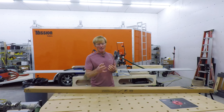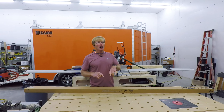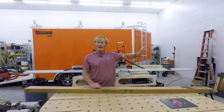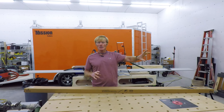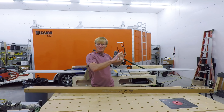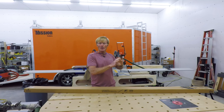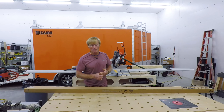I'm going to have a pigtail going into a two-gang box with two outlets. From there, I'll feed out with MC cable over to another two-gang in the battery charging compartment. There'll be two outlets in the back, which I'll plug a strip into. Then I'll jump from there with a short piece of MC cable in the same cabinet and have another two-gang — one with a switch for the lights and another with an outlet that will have USB plug-ins for charging phones and other batteries.